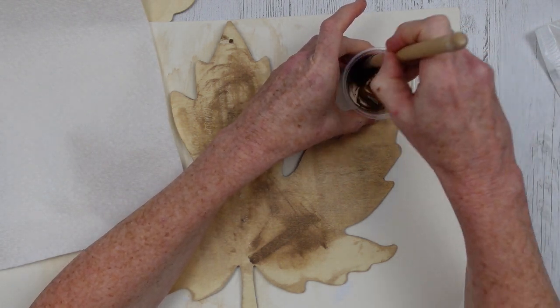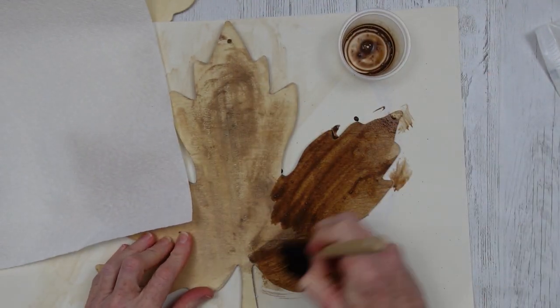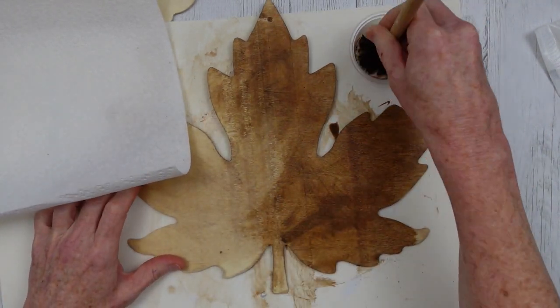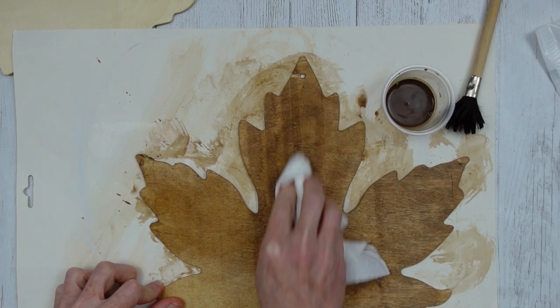This is the back of a sign that I used for another project. So we're gonna take a little bit of that antiquing wax, water it down, and grab a brush. Start putting that on because we're gonna use this as a stain — that's why you make it a little bit weaker with the water. But you don't have to do it this way; you can put it on full strength if you want a darker color. I'm just gonna go back over and wipe it off.